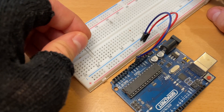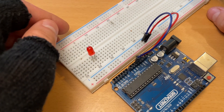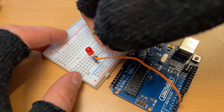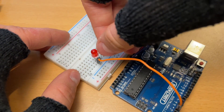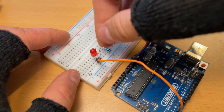Alright, now let's take the LED light. We've got a shorter pin and a longer pin — the longer pin is on the left side, the short one is on the right side. We're going to take the orange wire and connect it to the longer pin on the LED. Now let's take the 220 ohm resistor and connect it to the same row as the shorter pin on the LED light, and the other end of the resistor to the blue row of the protoboard.